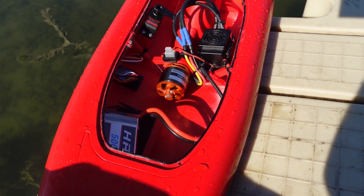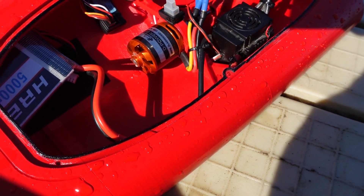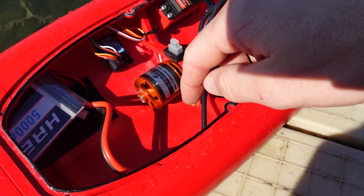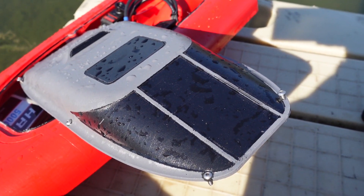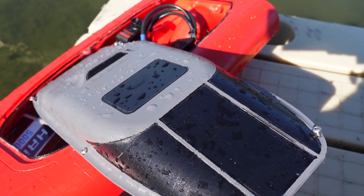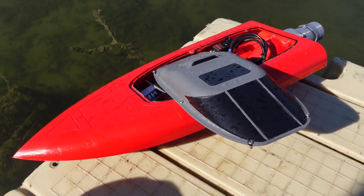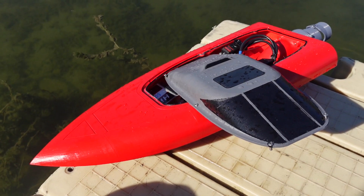You can see something is cooking in there — that motor is real hot. I'm definitely glad I put that ABS motor mount on there. The speed controller is a bit hot but not too bad. So the last thing I'd really like to do is add some cooling. One way would be a water-cool motor mount that attaches to the outrunner motor, which would help. Another way would be to drill out the scoop — you'd get a little extra water inside, but it might be worth it. There's no two ways about it: that sealed chamber is going to generate a lot of heat on 3S or above, so unless you're running 2S you're definitely going to want some cooling long term. That said, I'm super pleased with the RC jet boat — it's extremely fun to drive and I recommend you build one as well. Take it easy, and remember: if you're looking for cool ideas for 3D printed projects like this one, kits, parts, and instructions, check us out at rcprinkter.com.